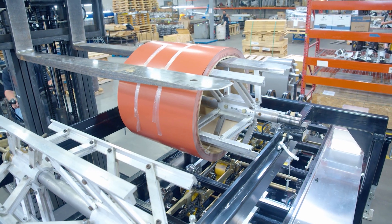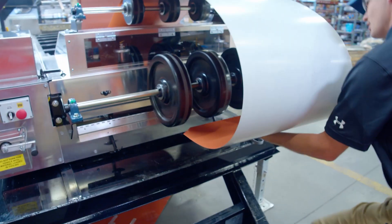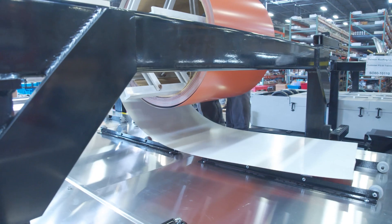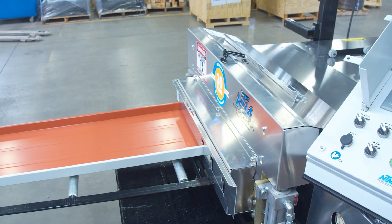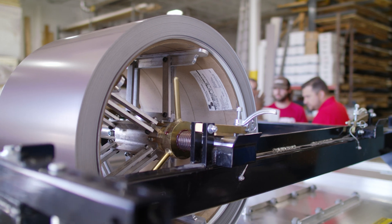Check New Tech Machinery's website for coil widths and finished panel widths on each of their roof panel machines. Depending on your machine's weight and dimensions with a trailer, it may not hold all sizes of coil. Understanding the machine's weight on a trailer, overhead reel rack capacity, and maximum coil diameters is helpful when ordering coil from a supplier. The dual overhead reel racks on all roof panel machines can support up to two 3,000-pound coils for a combined weight of 6,000 pounds. The SSQ2 machine with optional notching can only support up to two 2,700-pound coils because of the added weight of the notching units. The maximum coil diameter is 32 inches with the overhead reel rack and 45 inches with a freestanding decoiler.